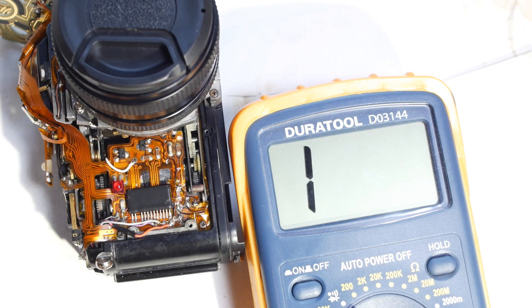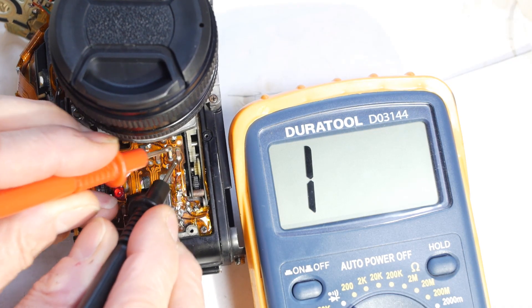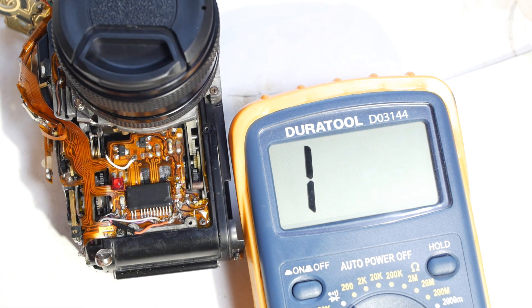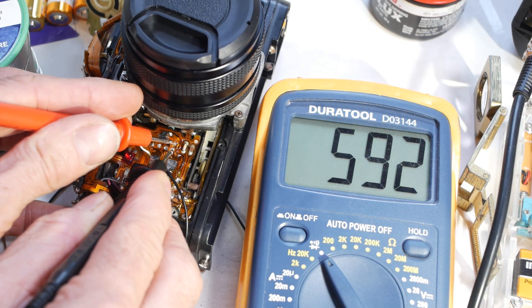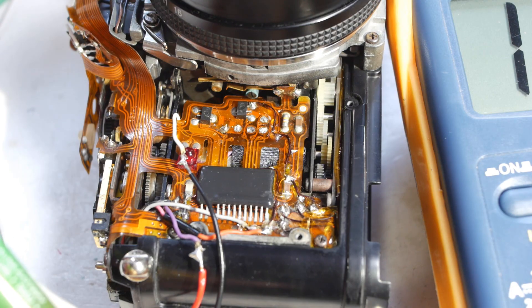So, let's do some testing. Somewhere there is a short that's draining all the power out of the batteries when I turn the camera on. If I'm lucky it might be a track on the board, or even a jumper wire that I've connected in the wrong place, although I doubt that because the camera did briefly work. It could be a capacitor of course, so I'll check a few of those. C9 and C4 are okay, but C8 and C7 are reading a dead short, so I'll pop one of those out to see if the problem clears. Bit of a false alarm — part of that apparent short circuit was the position of the transfer switch; if I move that, the short clears. And the motor was reading as a short, although it's actually fine and still working if I connect a battery.